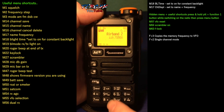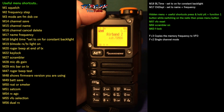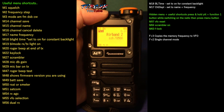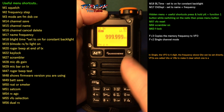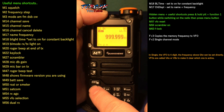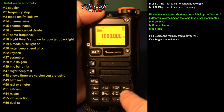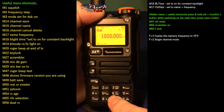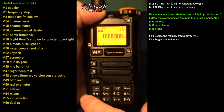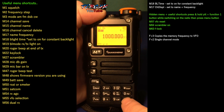The frequency steps change increments depending on what modulation — SB, AM, or whatever you're on. To enter a frequency above 999 MHz going into GHz, you need to be in single screen full screen mode. You go to VFO with press and hold 3. I want to go into 1 GHz here, and you can do your frequency step with 9 and do your searches. You can frequency capture as well with this.